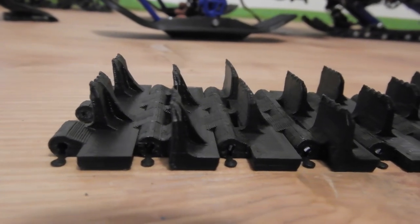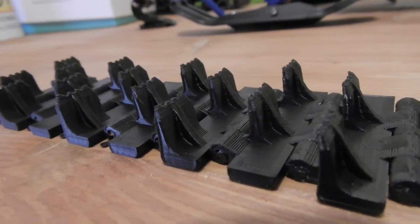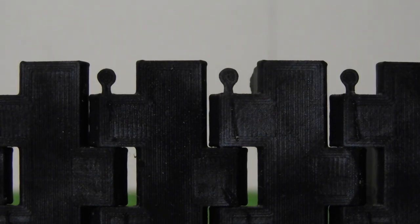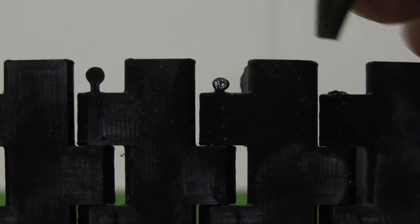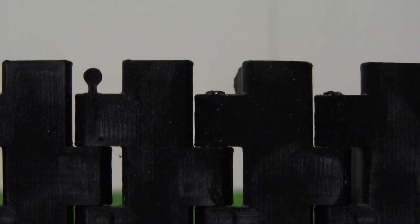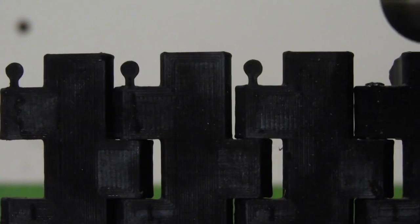Here's a look at the new track. As you can see every lug is tilted slightly backward — that's because you don't want to just shove snow out, you also want a bit of compaction, which helps get you forward. I also made a little improvement for preventing the rods from going out: you just heat up these little pieces, and when they melt and start to move you compress them with a screwdriver or pliers. It locks the metal rod inside. It's quite convenient, though I haven't broken one yet so I don't know how hard it'll be to take off. In theory you should just heat them back up and bend them back.